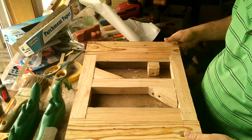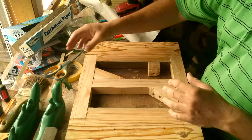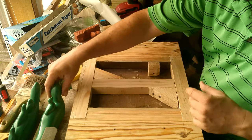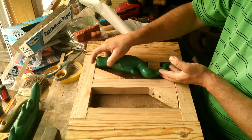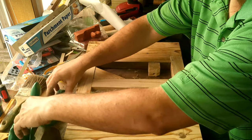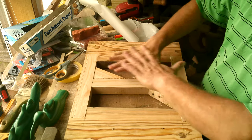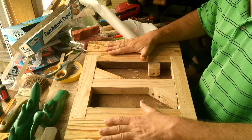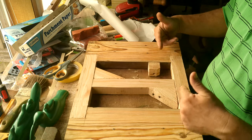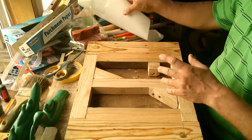To get started, I've made a simple screw-and-frame construction — not glued together. Some of these little corner pieces just fill space so we don't need as much clay. Wood is a whole lot cheaper than polymer clay, so I was trying to leave the smallest possible cavities to fill. Some corners are tacked with super glue and then screwed; there's a little bit of flex in it yet, but we'll deal with that as we go.